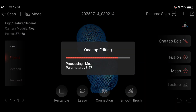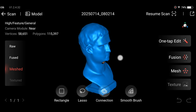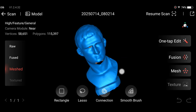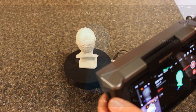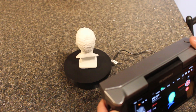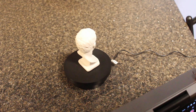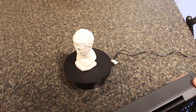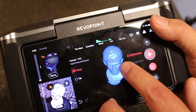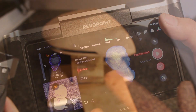So that's a problem. If you tap edit, you can see he's got a couple of holes here, and we don't want that in our prints. So instead of just having the scanner set up on the tripod and being stationary, I decided to move the scanner up and down very slowly in a controlled manner. This allowed it to catch all of the angles — it spun maybe four times around — and I was able to catch all of the details with no more holes. That's how it's going to have to be done.